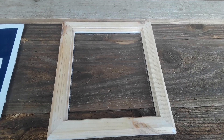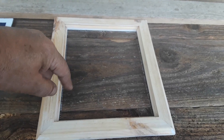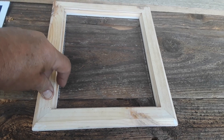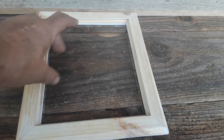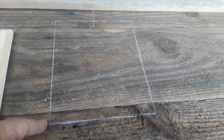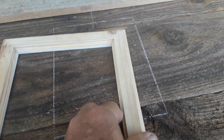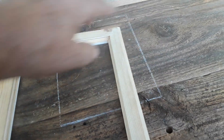I'm laying out where my frames are going to go and I've cut them. I've laid them out where the glass is, but there's a piece that's bigger than that. So I'll cut to the side of the line — I may draw it out or just do it freehand. This is the front of the frame and this is the back. I'll glue and put a couple screws going in here, and that way this will help support the rest of this.